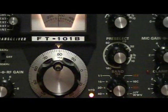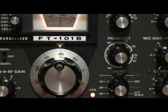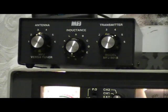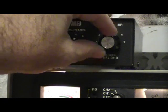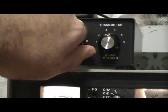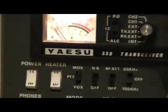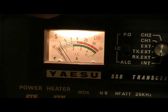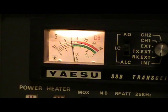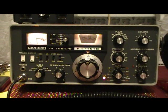Next, we're going to turn the pre-select for best receive. If you're using a manual tuner like I am, you'll see an inductance control. Put the antenna and transmitter cap roughly at 12 o'clock, then turn the inductance for maximum receive. If you watch the meter, you can see the needle — turn the inductance and it shoots right up to seven and then drops off. Keep it at seven — that's maximum receive.